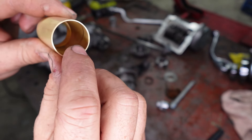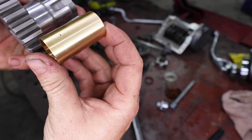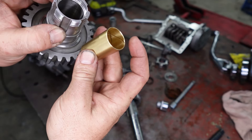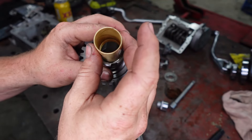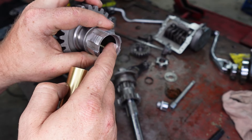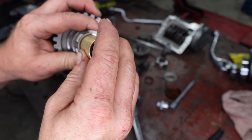And you see it's got these helical cut grooves in it — that's to suck the oil back into the gearbox. So this thing has to go in this direction. These little grooves go to the inside and these helical cuts go to the outside like that. So when we press this in, I want this edge to be flush with this little countersunk edge here, because our little seal sits on top and we want this to be flush with that countersunk edge.